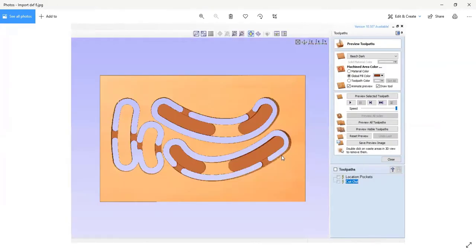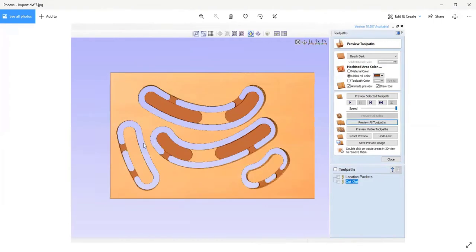So there's the tool pathing. And again, everything works out here, but the tabs that are holding it over here probably aren't going to work very effectively. So I repositioned the drawing, and one of the cool things about the software is that very often you can just recalculate the cut path, and you don't have to redo all of this. It just automatically adjusts. But again, the darker parts here are the pockets that are cut out.